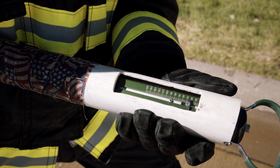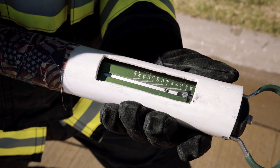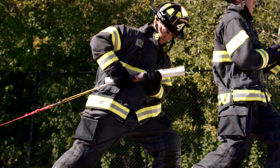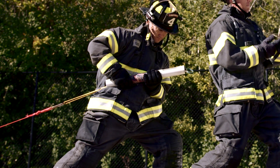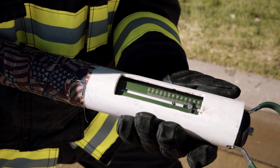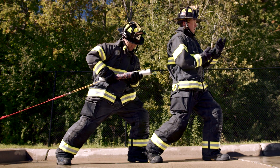If this is an inch-and-three-quarter line flowing about 180 GPM, there would be around 69 pounds of nozzle reaction. As you can see, the backup man is only at about 30 pounds. This is typically what we see — firefighters don't realize how much nozzle reaction needs to be countered. Realistically, the nozzleman is picking up some of that, so the backup man doesn't have all of it. But having that scale in front of you to see exactly how much nozzle reaction you need to counter is invaluable as a training aid.